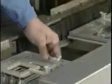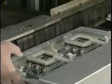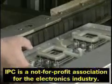When manually loading assemblies, place them gently on the conveyor fingers. It is important to periodically monitor the conveyor for any changes in speed, for smoothness of travel, for scummy fingers, and for finger cleaner level.